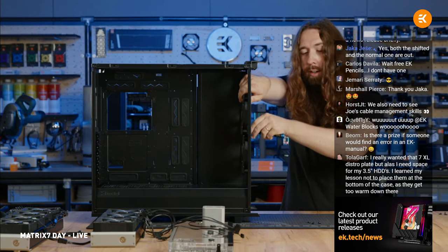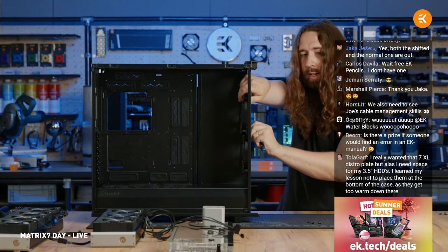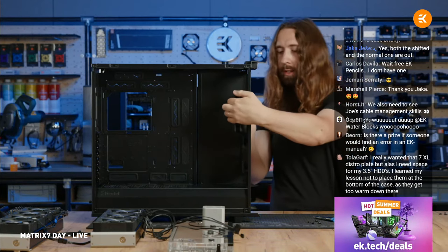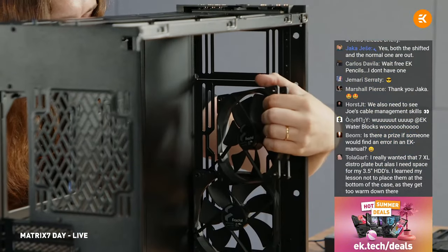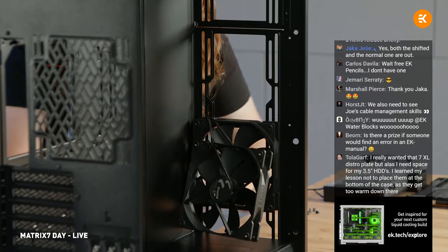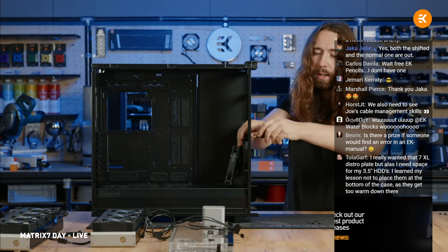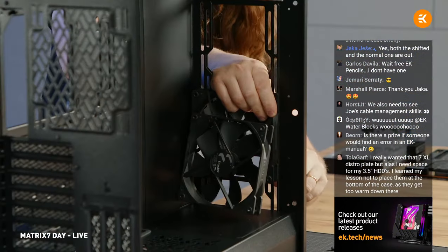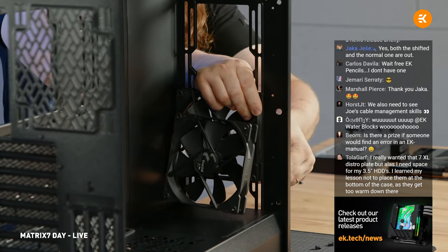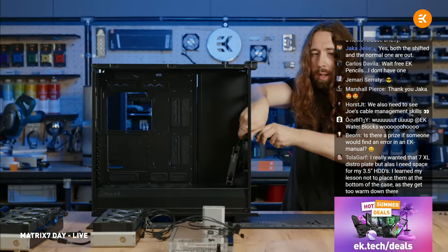We're also, while we're on the subject of distribution plates, rolling out a few updates. You will notice already that the Evo manual shows you the direction of the coolant flow. So there's one annotated sketch with little arrows on all of the channels. And you can see now very graphically how the pump is configured in the distro, you can see which order things are going. And hopefully that helps people figure out what's actually going to happen at each one of the ports, at each one of the holes, when they trace the loop through in the manual, and they can compare it to their build, and they can see what they've done, if they've maybe skipped a part or something.